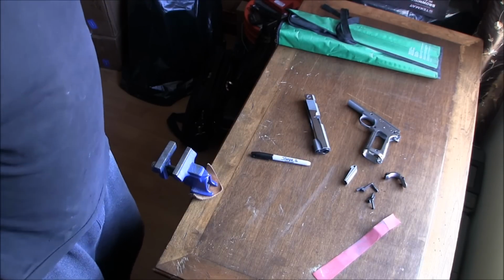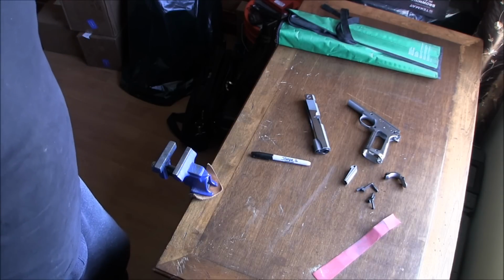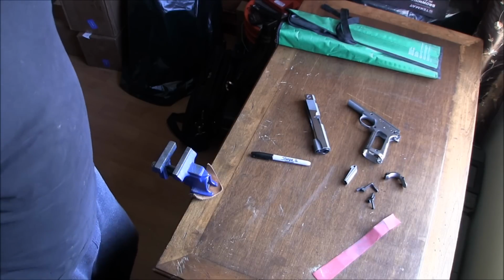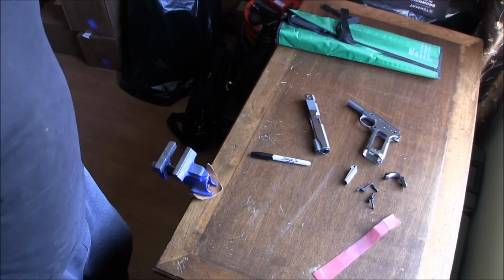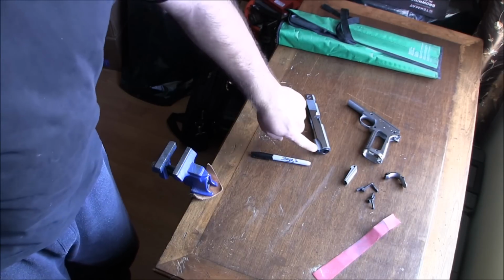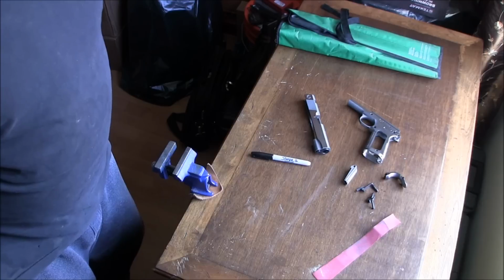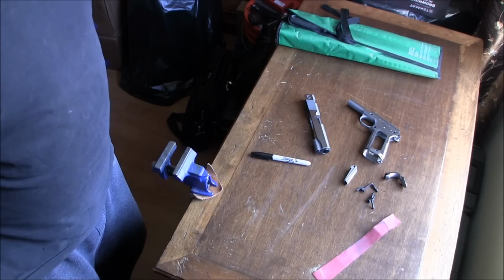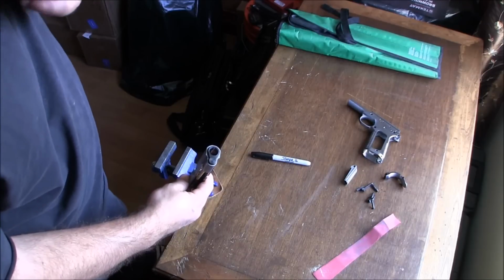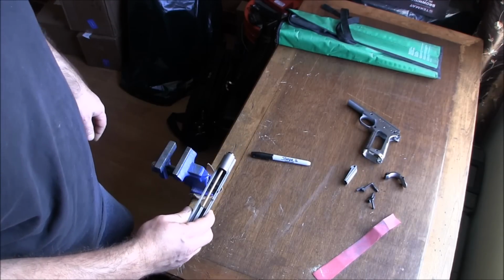I don't know if you're familiar with Rogers Precision or Chuck Rogers. He's kind of been an inspiration to me, and I'm going to try and do what he does in his pistols, which is bobnose the front of the slide. The only way you can do that is if you're using the EGW monogrammed bushing and spring plug, because they are indexed.